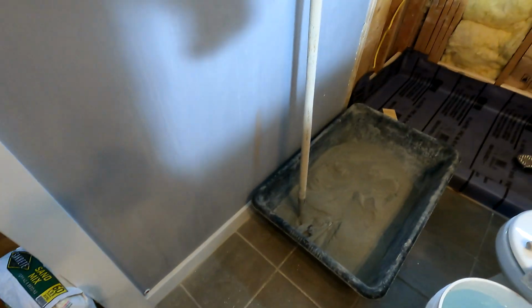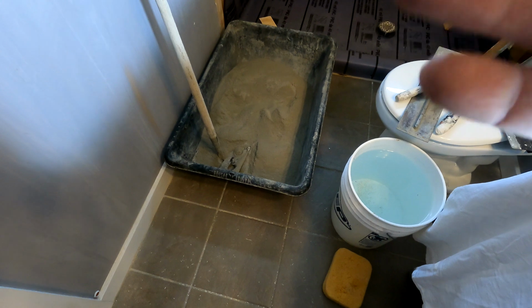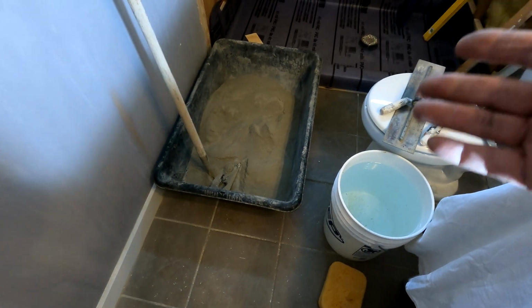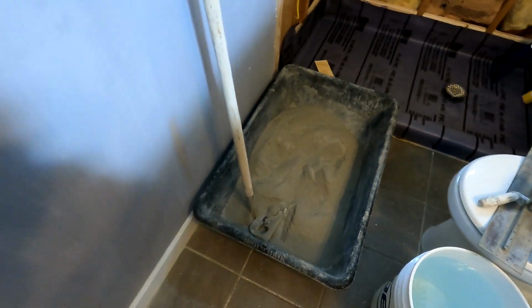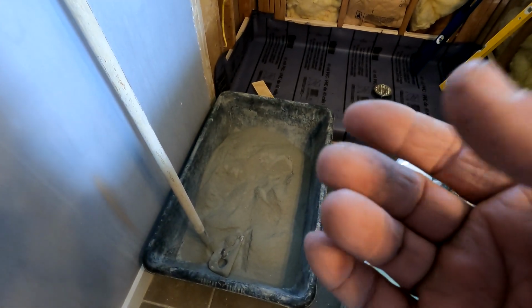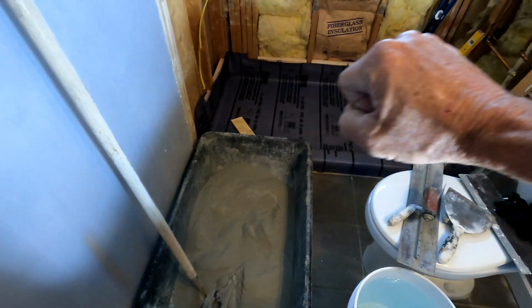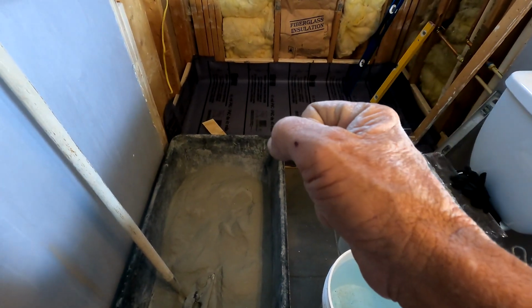When I used it the first time, I absolutely fell in love with it. I've been using Quikrete from Home Depot for probably 20, 22, 23 years. And when I started using Sakrete, it's like, ooh, I just fell in love. I think the reason is the aggregate, which is a sand, is thicker than what the other brand is. And because it's thicker, it just screeds. It does all the things that I want it to do easier than Quikrete does.